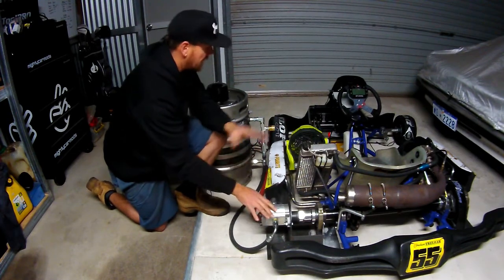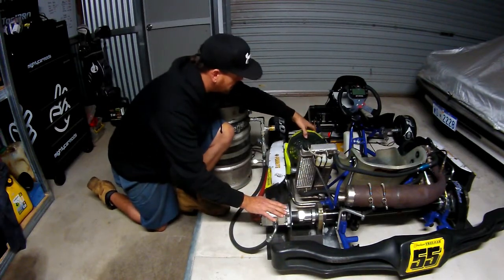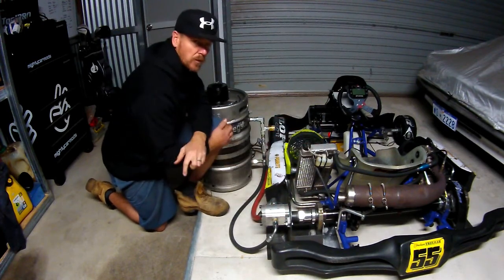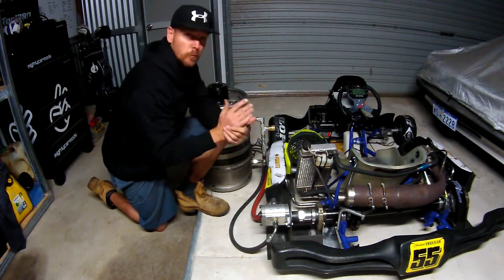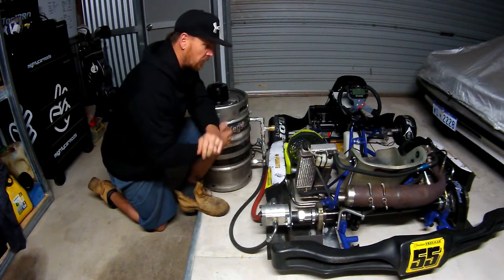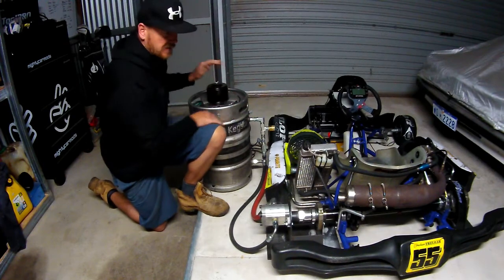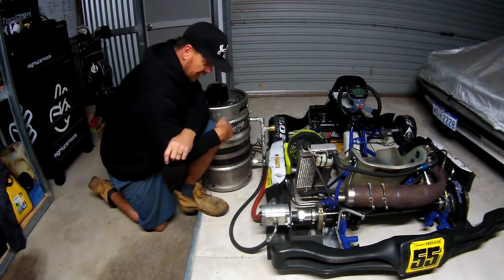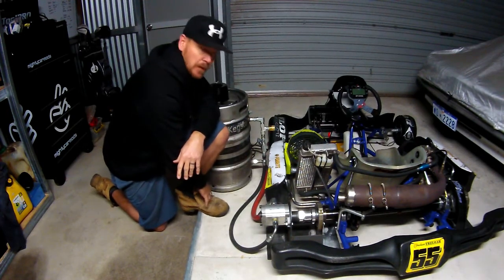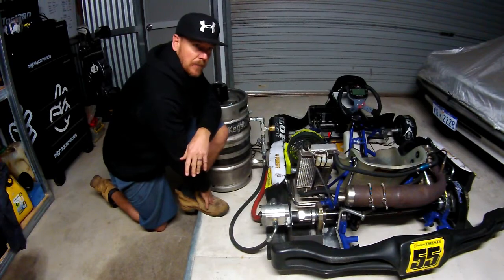Other add-ons for this week — some simple ones. We've got ourselves a little radiator fan to try and keep the radiator cool. It's very easy to get it extremely hot, because a dyno pull can go for 20 seconds or more at full load — lots of RPM produces a lot of heat really quickly. So we'll keep it cooled off during and between runs with the fan. We've also got a little breather on our hydraulic tank — not sure how needed it is, but we'll put one on just to be safe. And we've got our laptop ready to go, so we'll do a couple of runs and then crack out the computer and see if we can come up with a graph or two.